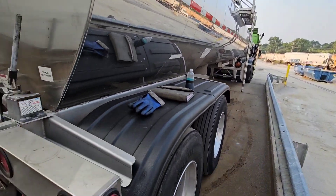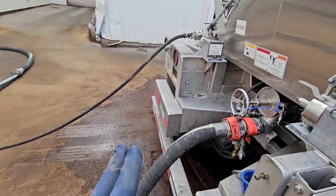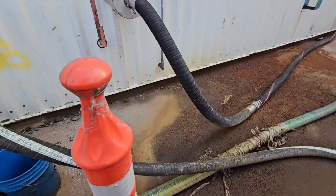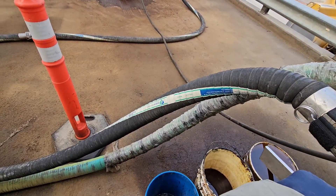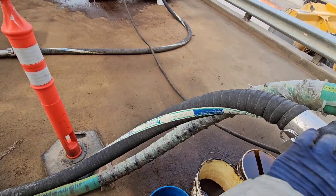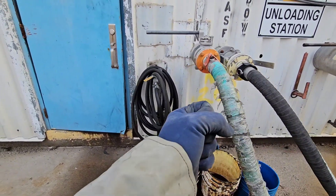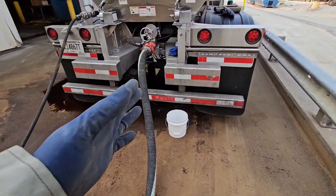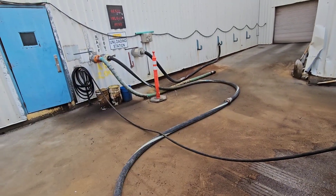As you can see, the driveway slopes down. This is a real thin liquid, so this just comes right off. In a way, you can tell if you're unloaded. If you're ever in doubt and you don't know whether the product is flowing, here's a way to tell. Come here to the valve. Close this valve. If you see that hose jump — see how that hose jumped? That means the product is flowing. Because when you immediately cut that flow off, that stop, that surge all of a sudden. Just like the surge in a tanker when you're driving. That product just stops and it's a braked stop. That's one way you can always tell whether your product is flowing or not.